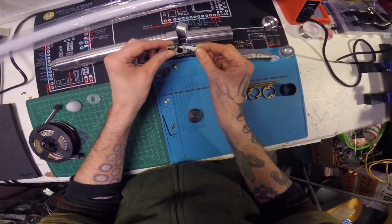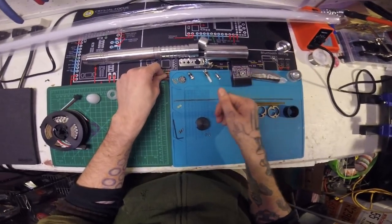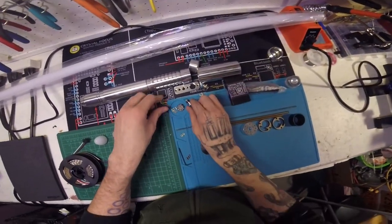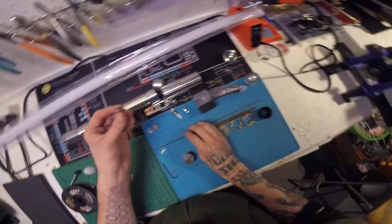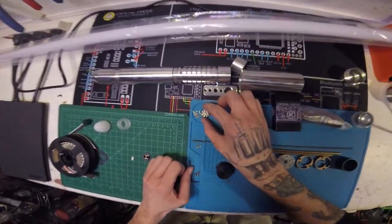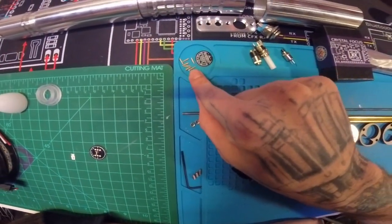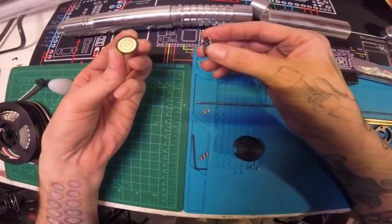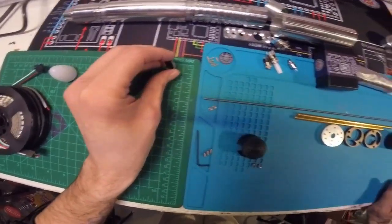The recharge port has a little kill key in it, which is a plastic rod that cuts power to the board so we can solder the battery on and still safely solder without worrying about power running through it. The rice port is used to configure the saber by connecting it to a PC so you don't actually have to take the SD card out to make changes. We also have this hilt-side NeoPixel adapter which gets seven little spring-loaded pins soldered into it so that when the blade makes contact with them you have a nice connection and get good electrical signals to the blade.